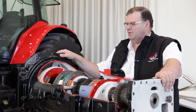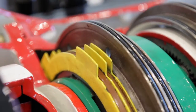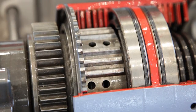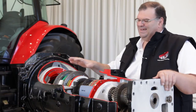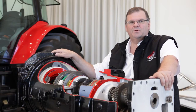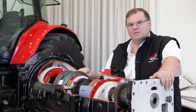The power shift unit at the front gives us six available power shifts in each gear — A, B, C, D, E, F power shifts — along with our one, two, three, four main gear changes, and then forward and reverse in the middle. It's not based on the normal method of using hydraulic clutch units and clutch packs; it's based on a mechanical epicyclic unit, and we simply select the route through the epicyclic units to give us the six different speeds. So it's very efficient, very reliable, and it's a design we've used in our previous Dyna-Shift models and now use in Dyna 6.